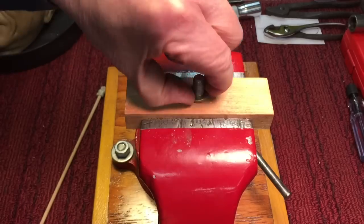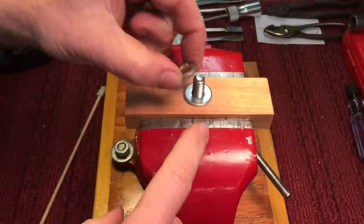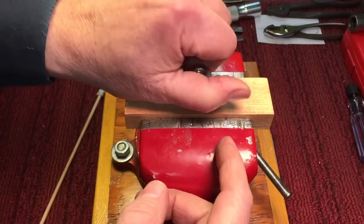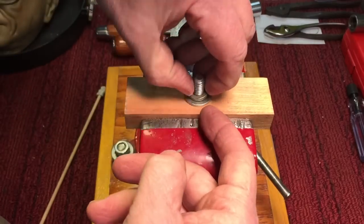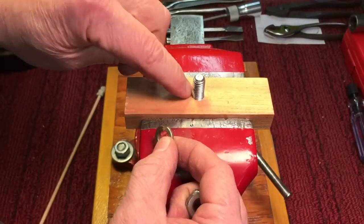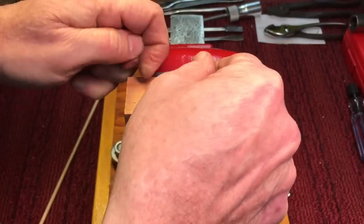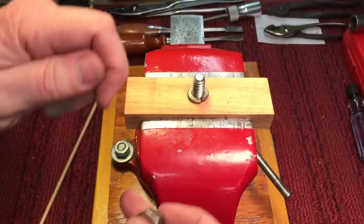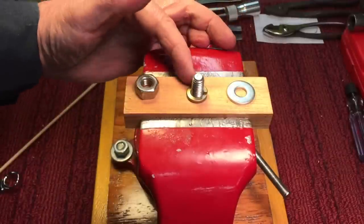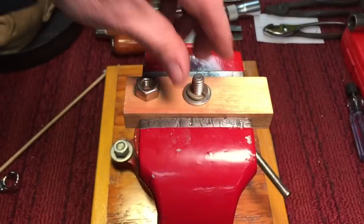I just tightened it up enough that you can see what happens — it is wood. Now loosening up here, you can see that the washer has dug into the wood a little bit. If we look very closely, you can see the impression that was made right here from the lock washer digging into the bottom. That's how the lock washer stops the nut. The same thing is happening to the nut on a smaller scale. So my question to you is: do you put the lock washer on alone, or do you put a flat washer on first? Now I know what you're thinking — since we were kids, we've all been taught flat washer first, then lock washer, then the nut. Everybody's been taught that way, but does that mean it's right? I was on a couple of engineering forums where engineers have brought up the point that you're negating the whole idea of what the lock washer is supposed to do. If you go directly with the lock washer onto your base surface, you would have a much better grip than if you use the flat washer first. What's your opinion on that?